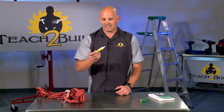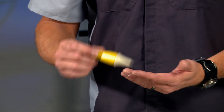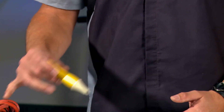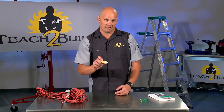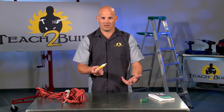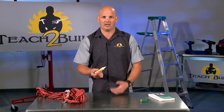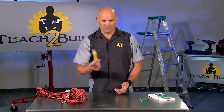This device here is called a Voltic. You'll see the light come on — as long as I'm holding it, it will detect electricity even through the insulation of wiring, and it's got a narrow blade so you can fit it into an outlet. We use these to test and make sure that the electricity is in fact turned off before working on an electrical outlet or a device of some kind. It only takes a moment, so they're a great device.